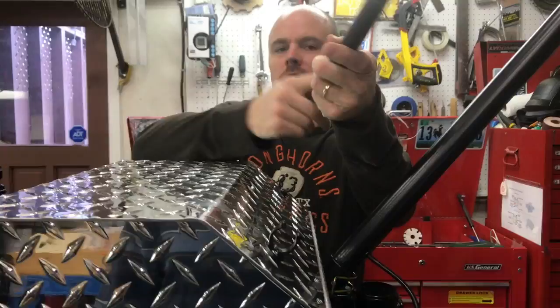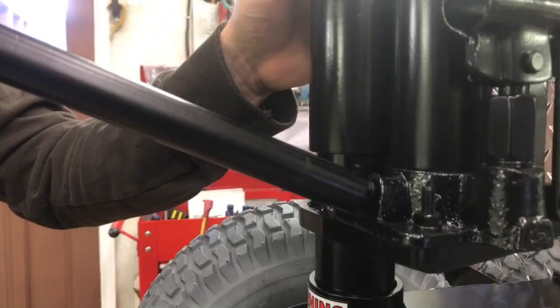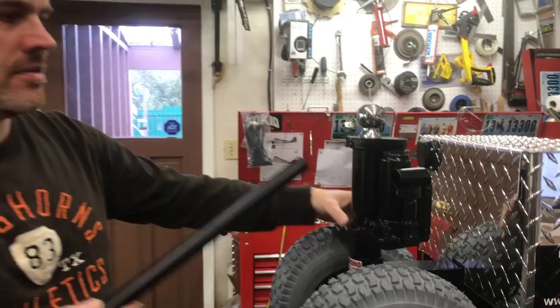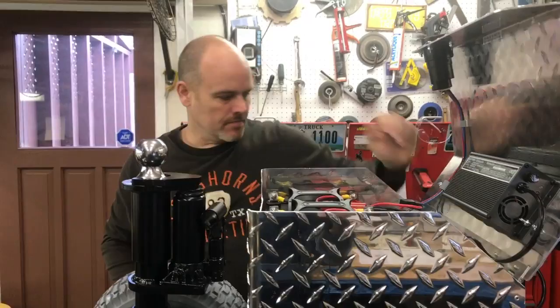The charger in here — you can see here is where we store our handle. This is a jack handle that goes onto here, our bottle jack. So obviously we can crank this up and that would clamp onto the tongue of your trailer. Or there's a little groove in here and it's just like any other bottle jack: you turn it counter clockwise and the jack will go down, then turn it clockwise to tighten this screw up again and you're ready to jack up. We just store this guy back here in these two clips inside.